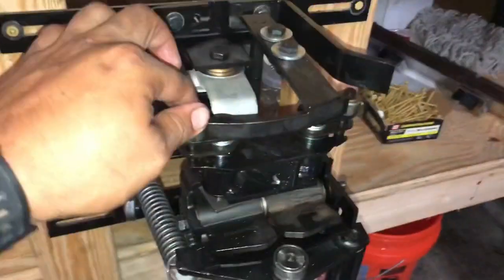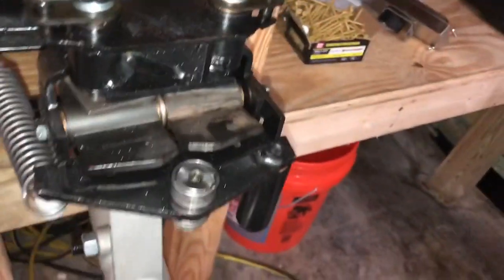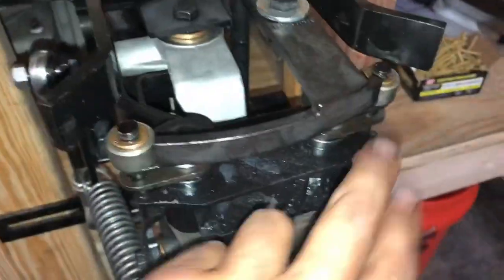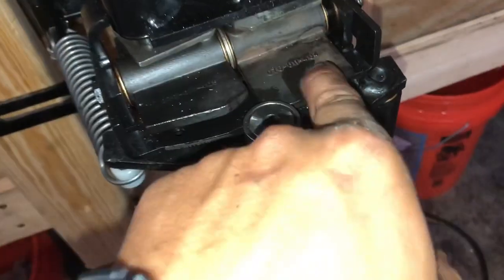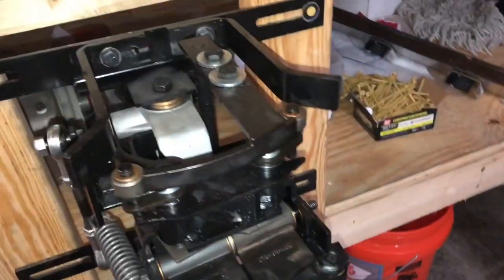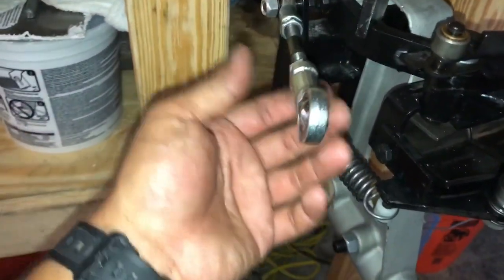When our jam clears up here — the ball goes to the left, the pins pushed out of the way — we're going to come back over, hit the reset cam, and open it back up. Then just like that we can go back and forth again. Now it's locked and we can unlock. That's all we're doing: pushing this cam follower back and forth. All you've got to do is hold your rudder still, let the machine drive the thing, and just watch. Adjust this trip cam so that when it's locked it'll push it down without binding, and push it all the way down so that this engages.